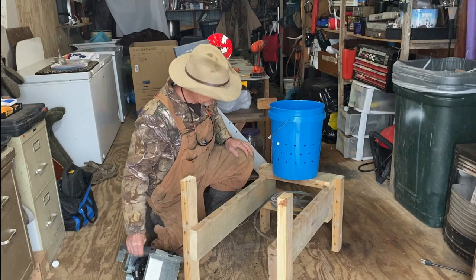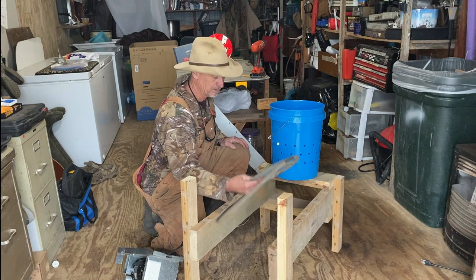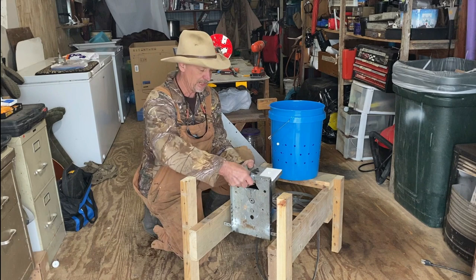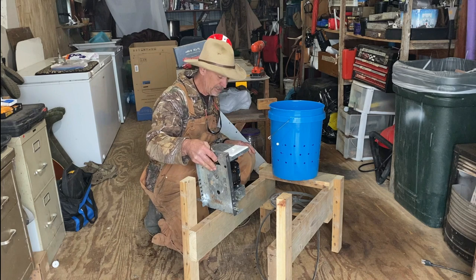but I'm as far as I can go because I have to have my pillow blocks to go up under here from my shaft and to put this big pulley on. And that'll be my shaft, bucket to set on that end, and then I can use this motor. I have to change my length here to fit my belt once I get my pulleys up and fasten that motor on right there. So that's where we're at today, and that's as far as I'm going to go until I get my pillow blocks in and my 1 inch pulley for this.